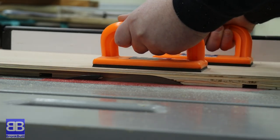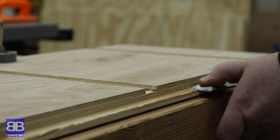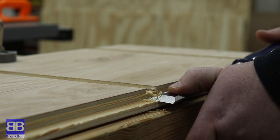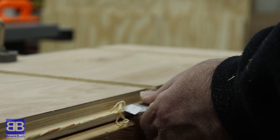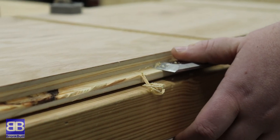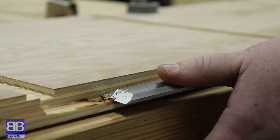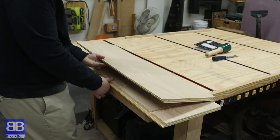This way he gets to learn a new skill of cleaning up the cuts afterwards. Now it's time to clean up the rabbet joints, and for that I thought it would be great to teach Eric a little about chisels. My chisel skills are probably just above Eric's who has never held a chisel before, and I also don't have the sharpest chisels. Even with all that, he took his time and eventually ended up with pretty clean rabbet joints. We did end up grabbing a sanding block for the final touches. Here you can see both side pieces completed and everything lining up perfectly.